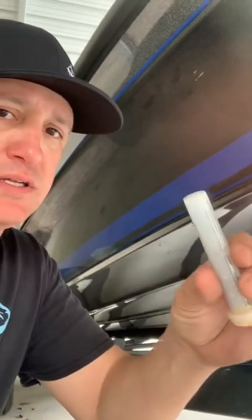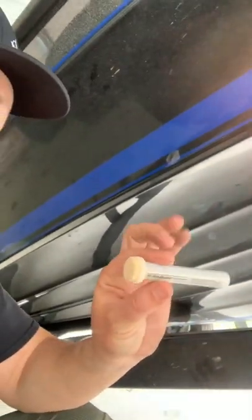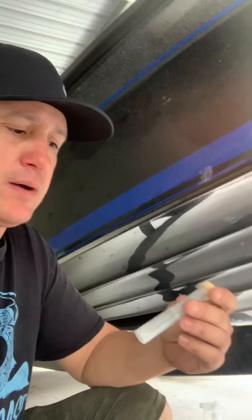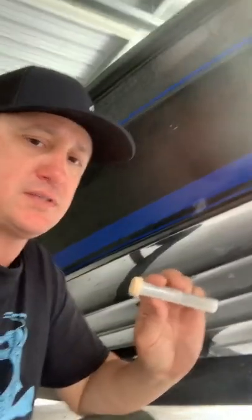My area is sanded and I'm ready to apply the primer. They have detailed directions on how to activate it — it's pretty simple, just follow the instructions. One key thing: after you sand the area, clean it really well and let it dry before applying the primer. One of the steps says to let the primer sit for at least five minutes before installing the actual keel guard. This is a primer to help set the glue that's on the actual keel guard, not a glue itself.